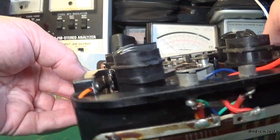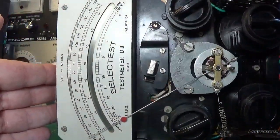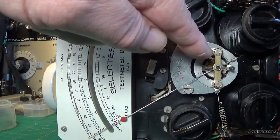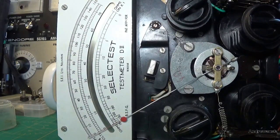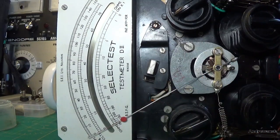So that is a success so far. I'm going to leave it like this for a bit and I'm going to have a cup of tea, and we're going to come back when the paint has hardened off a bit. So obviously as the paint evaporates it's going to get lighter on this cruciform bit here, on that cruciform bit, and the needle's going to swing upwards again slightly, very slightly. There. And then we're going to check it in the other plane, which I could do now actually.